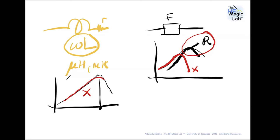What is the main reason to place the input filter on the opposite side of the power supply at the second board? Yes, this is what I answered before: in this way, you minimize the parasitic coupling between the DC-DC converter and the output filter. So the output filter is not detecting the magnetic field coming from the DC-DC converter. It's some kind of shielding. You are using the inner layers to separate both areas.